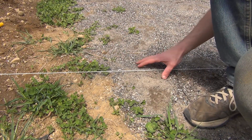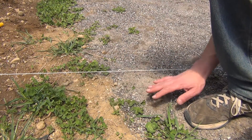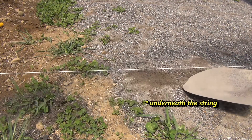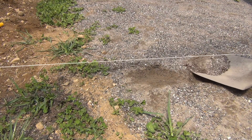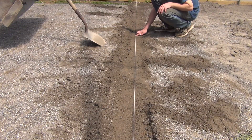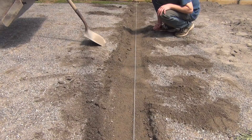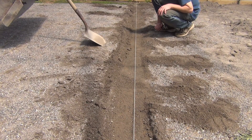I was saying earlier that the sand was a little too high in some spots — you can see here the string is hitting against it. So what I'm going to do is dig out a little trench underneath the string so that it's always floating, which will help me guide where I need to remove material later on. Now the string is free-floating all the way down with about a half inch or so underneath it — that's what the final grade is going to be, just underneath the string. Now I can fire up the tractor and scrape all the higher stuff and push it off to the edges where it's too low.